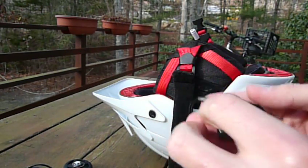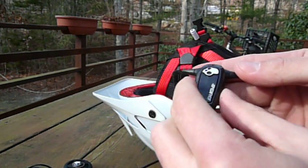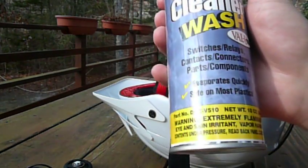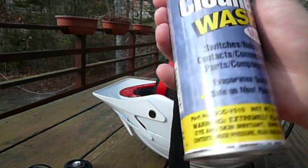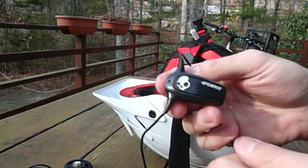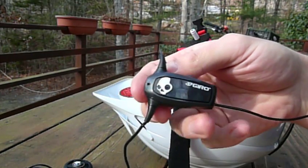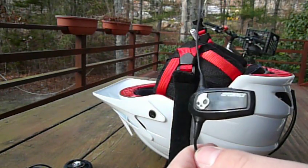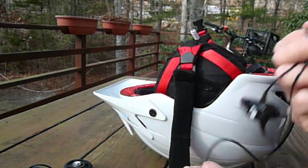And at this point you should also turn the volume control a few times, because this stuff removes any oxidized copper or any oxidized metals from the surfaces that transmit the sound, thereby reducing your sound quality or not giving you sound at all. So after you've done this, at least for me, this has worked very well so far. And that's it.